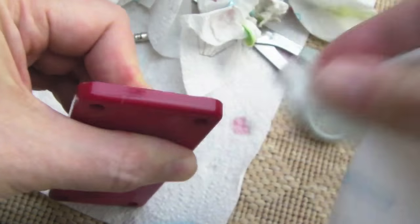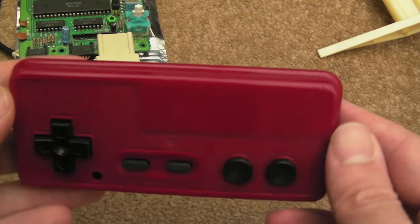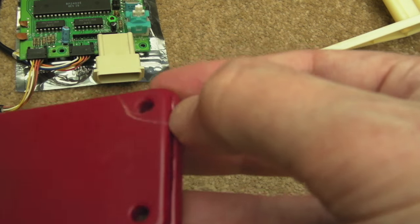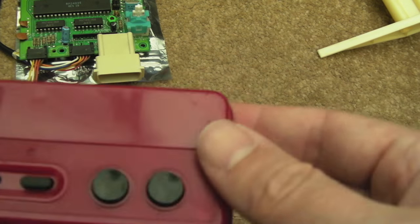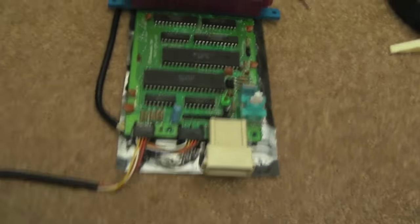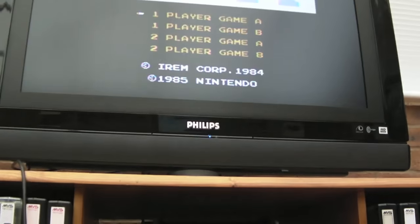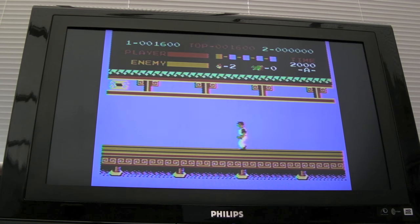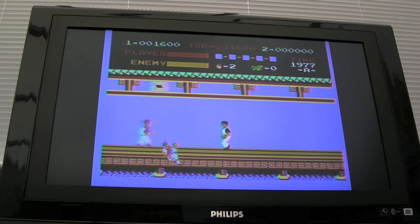So just a close up here on these faulty SRAMs. On the NES you've got the same chips — there will be two of them again, but I think both of them are the wider type. And an interesting side note: with some of the faulty Famicoms I've got coming, I might take a PPU and CPU out, put them in my PAL system and convert it to US — I think the only other thing I need to do is change the crystal. You can see the corrosion down here — that was the telltale sign there was something wrong. And there's definitely nothing leaked onto the board from outside — it's come from within the chip itself.